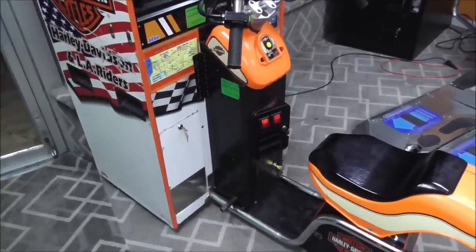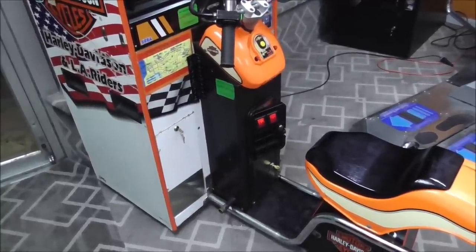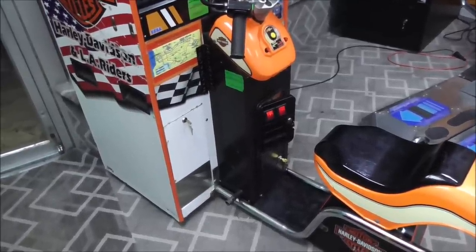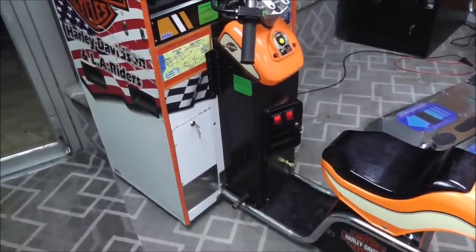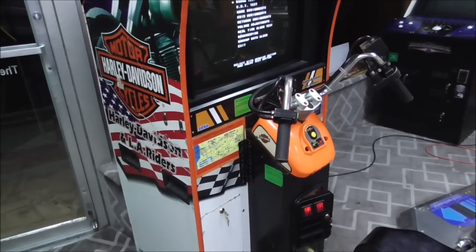I got some of the sound amps and replaced them, but that still didn't fix the problem. So there was one of the sound amps would get very hot and was just all distorted, and the other sound amp, that side of the board, would not work at all. So we bought a tested working soundboard. They're on eBay. I think it was about $60, but it's used. Put it in and the sound works fine. So that worked out good.